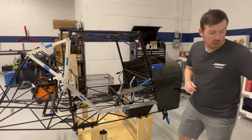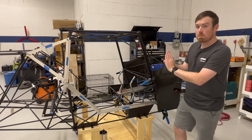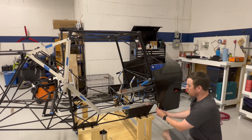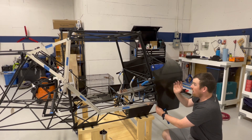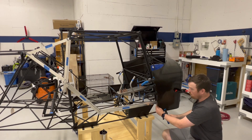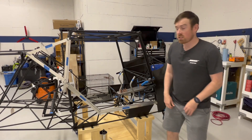The last tip was for this piece of angle that's going to get installed down here — it's where the fabric is going to meet the boot cowl — and you want to get this angle to be out a bit from the fuselage so that it's actually flush with the outer edge of the boot cowl. I'm fortunate that I have my boot cowl here with me, so I've used some clamps to hold it up onto the fuselage and then I can position this piece of angle as needed to get this smooth. Those were the tips I followed and they made the process super easy.